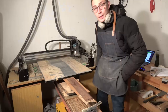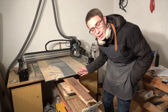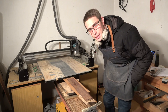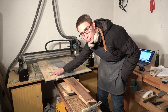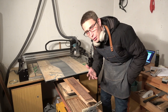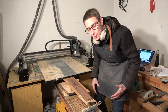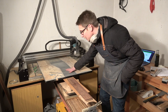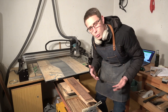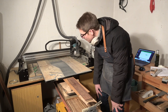It literally took me the last four days to shave off this table — as you might notice, it's only half its thickness anymore. It's seriously terrible; it hurts my heart and my wallet to see this but I just had to do it. It's still not perfect, I can still see a lot of epoxy shining through. The beech is just so soft due to the spalting process that it seems like the epoxy went through the whole wood at some spots, and I just can't bear to shave off any more. This is by far the biggest mistake I have ever made in my woodworking career — not using a coat of clear epoxy on the end grain and sides before the main pour. Especially on the sides, top, and bottom everything spilled over. Woodworking is a learning process, and basically putting $700 into the trash is my way of learning. Let's make the best out of what we've got.